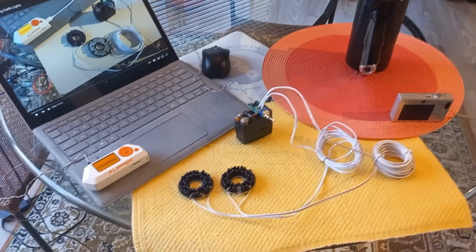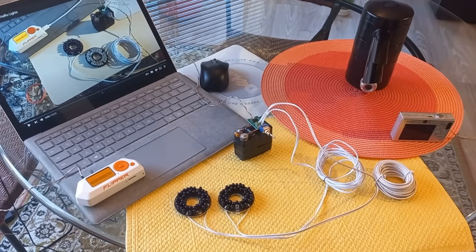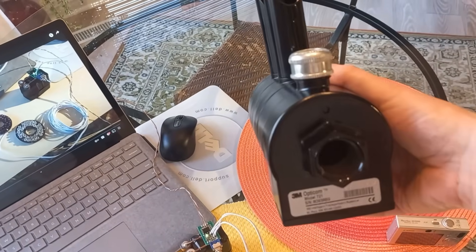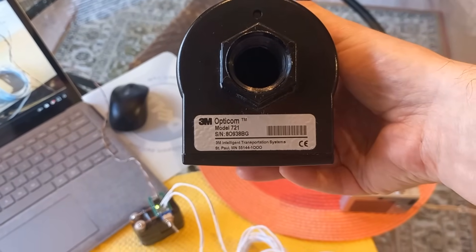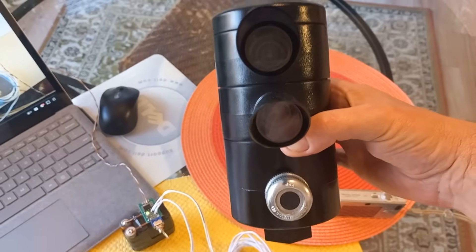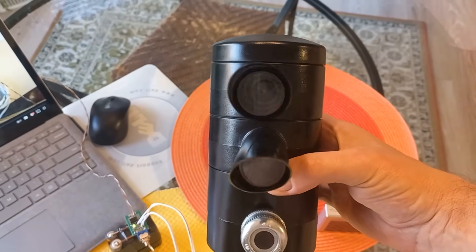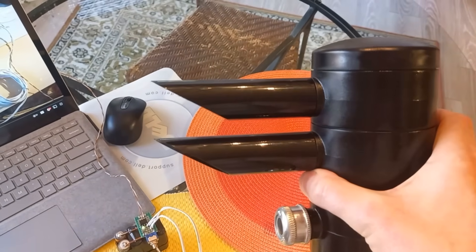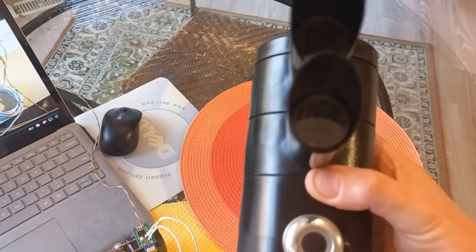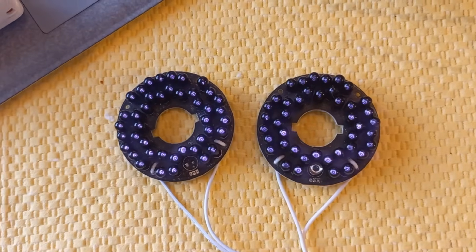What really started it all was somebody asking: can a Flipper Zero control traffic lights? I knew how the OptiCom preemption system worked, and it's based on one of these actual sensors, which I actually obtained. If you look underneath here, it is OptiCom made by 3M — model 721. This is a dual sensor that can be pointed in two different directions. It is an infrared optical system. Those lenses are focusing on an infrared phototransistor inside, and those tubes make it extremely directional — like blinders on a horse — looking straight down whatever roadway. It is looking for 14 hertz coming from an infrared transmitter.